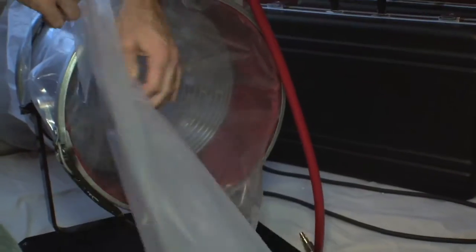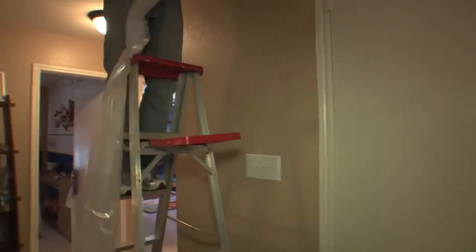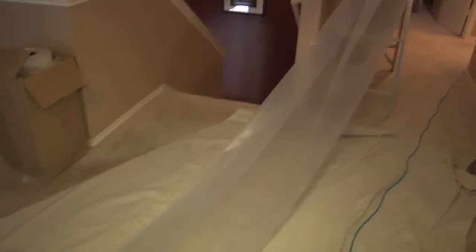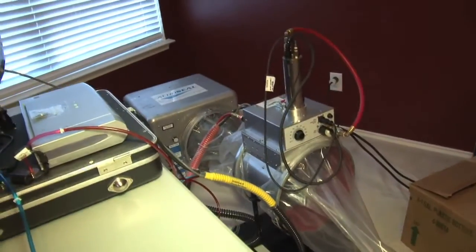When ductwork leaks, it puts the house under negative pressure. Your fan only knows one speed at the air handler, and what happens is it will suck air from wherever it can get it so that it can do the makeup air for all the air that's leaking outside of the air-conditioned envelope. That's one of the reasons why houses are humid. Normally, some of the most average complaints from our customers are inconsistencies in temperature, rooms in their homes that will not get very cold. In the summer, we have hot summers here, and having rooms that don't get cold with their AC, lots of dust in the homes, and high energy bills, but most of it's air quality.